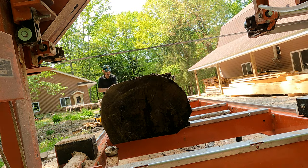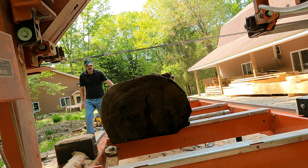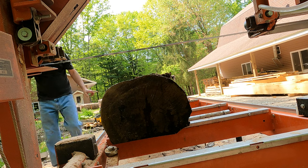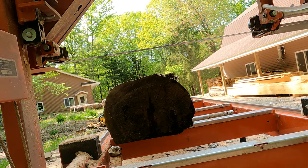Try and cut it since I want a 4x. I guess I'm going to cut it at 8 1/16, 8 1/8. So I'm going to go up 8 1/8 inches.